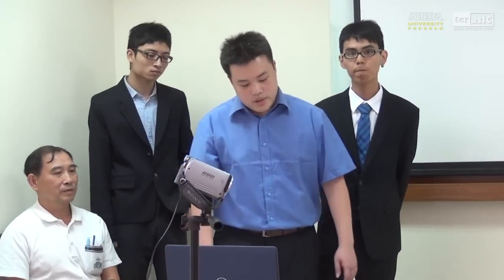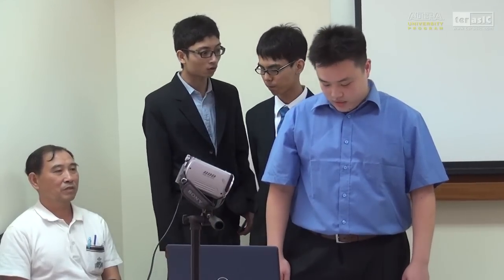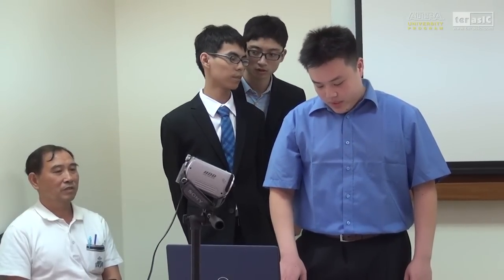As long as we place the phone near the NFC sensing area, we can automatically launch the application for the device, such as our fermentation pad. The topic is developed into three parts. The first part covers the API development, application writing, and the Android-based fermentation pad. The second part covers the design and implementation of the NFC tag by FPGA on the DE0-Nano board, where the external RF modules are employed.